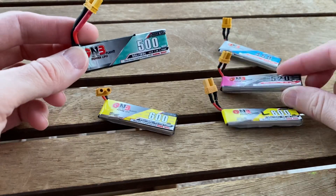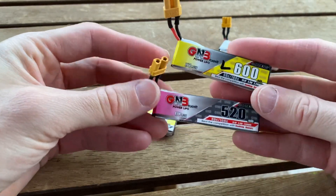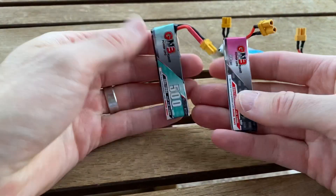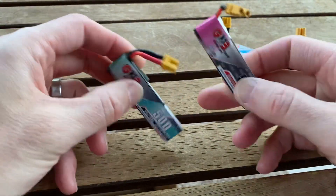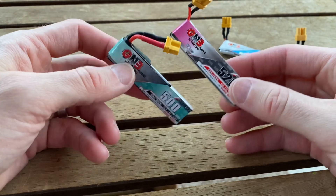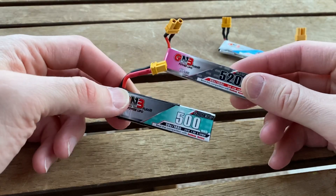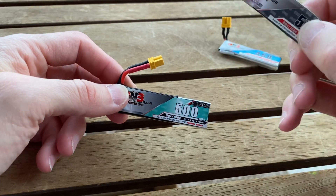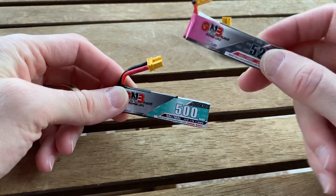So I repeated the test with these two cells, charged them both to just regular voltage — 4.2 — and interestingly enough, the numbers on these two cells basically became pretty much the same. So much so that I'm wondering if these might just be the same cell. They're probably not, but we'll see. The link is below — I updated the spreadsheet and added a column for the voltage I'm charging to, and the numbers and so on.